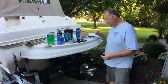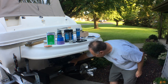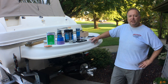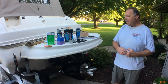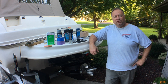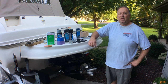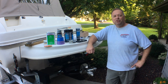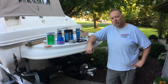So that is what I've done. The outdrive has been sanded, cleaned, and primed with two coats of paint. There are fresh anodes on the outdrive, the props have been polished, and the additional anode has been added. I'm comfortable that being a trailer boater, this is the right approach for me. Other options would have included completely removing the outdrive and bellhousing, having it professionally soda blasted and painted — unless you're pulling your engine for other reasons, you're looking at spending well over $1,000 to $1,500. The most expensive path is neglect: eventually the corrosion causes the oil to leak out, and there's no way to repair it — you need to spend $12,000 on a new outdrive and bellhousing. That's the worst alternative. I'm comfortable with what I've done, just recognizing it's not the only approach.